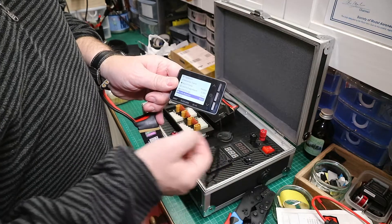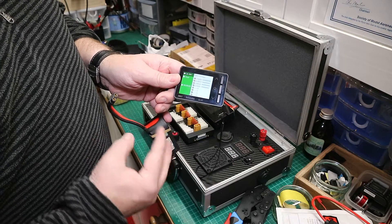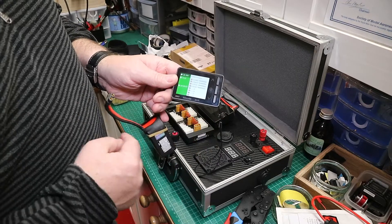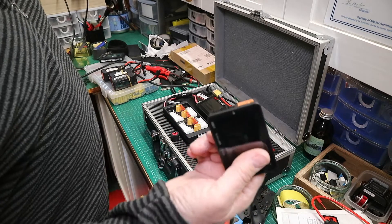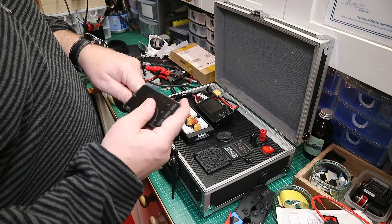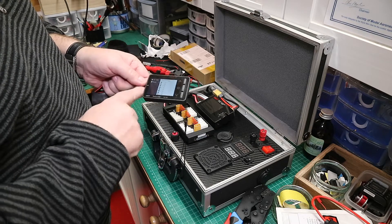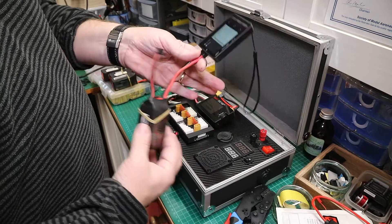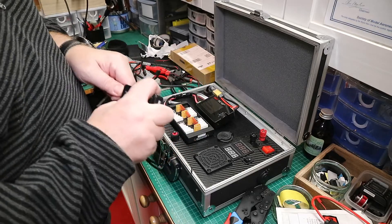Another feature on this is if you press, you can balance the cells. So that's now balancing the cells - what it's doing is taking voltage out of the high cells and putting it into the low cells to get an even battery voltage. These are good - they're about 20 pounds, bang for the buck they're pretty good. Another nice feature: if you plug your battery in there, you can then use it as a USB charger. So you can plug your phone in there and charge your phone off it, because that gives a regulated output there. That's a handy feature to have.